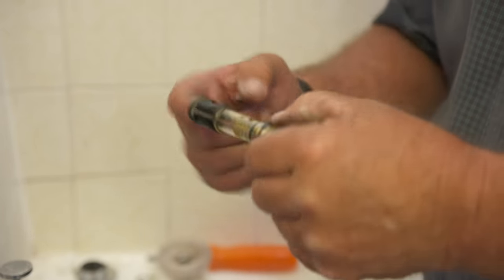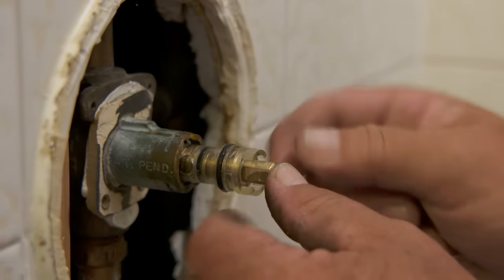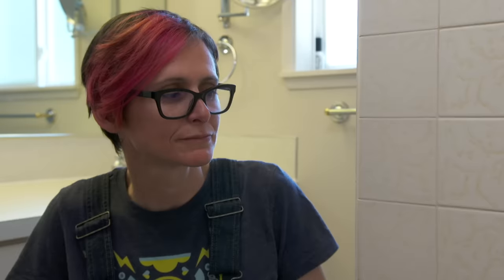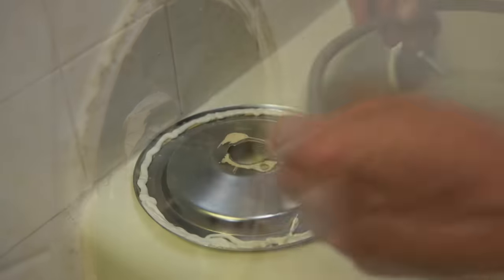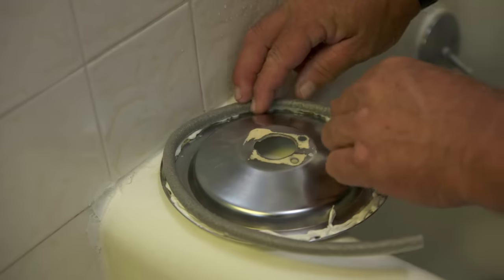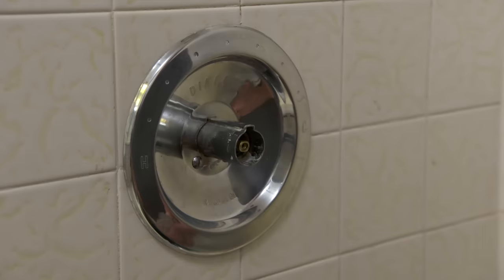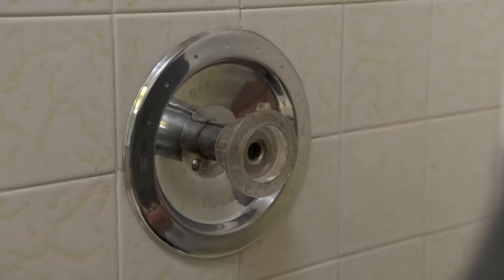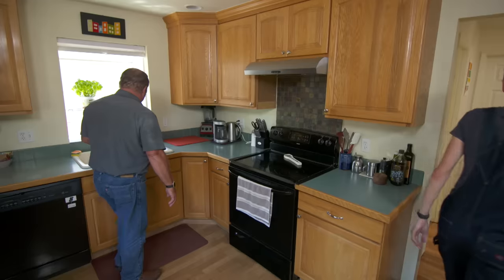It's not going to fully fix it, but this cartridge can dramatically improve performance. So we're going to put a little bit of grease on the O-rings — not too much. Add a little retainer clip. Set a foam bead into some wet caulking for a watertight seal, then reinstall the trim and the handle. Water is back on. Go into the bathroom and run the shower while I turn on the hot water from here. We'll give it a test.